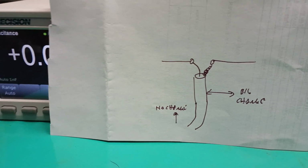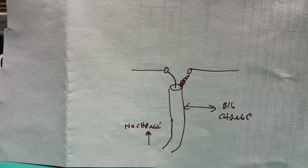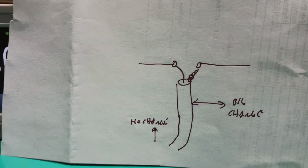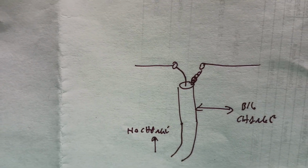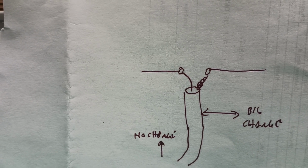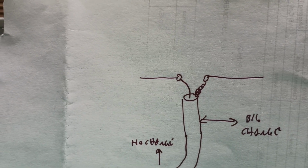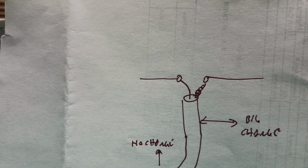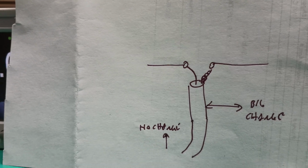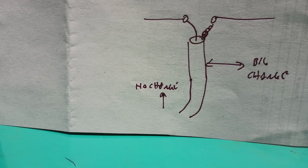What I found evidence of and tested today was that the reason that the match is sensitive to the transmission line going sideways along the wires is that when those charges come out of that center conductor, they were referenced to the shield from the inside. Now the fields are coupling between those 2 wires going up between the ends of the wire, and that is extremely little capacitance. And that is field mostly between the 2 wires. How does it get down to the ground? And that line going down and curving is like 20 feet, 17 feet on a 20-meter dipole.